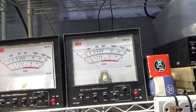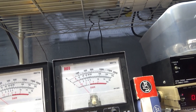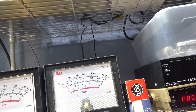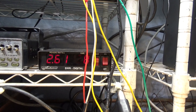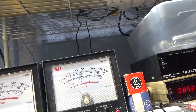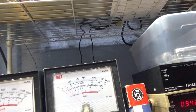That's the dead key on the 200-watt scale. Like I said, I've got it dialed down to two watts. It will dead key up to about 25 if I play with that input tuner. Input SWR is 2.8. If I dial the watts up it would lower that input and go down to about 1.4, but I like a low dead key. This is on average.